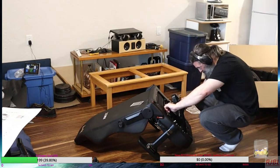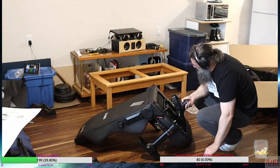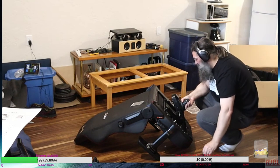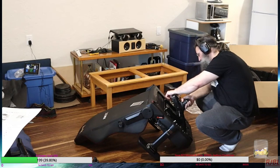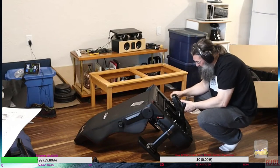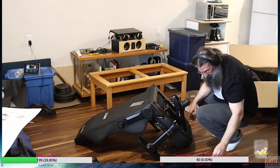Most of the time, if you're tightening down a flange or anything like that, even your water cooler, make sure you cross it from corner to corner. That way you get a proper tightening. If you only do one side at a time, sometimes it makes a bend in it, so one side will be seated tighter than the other. So when you're doing your water cooler, there's four, do crisscross. Don't do one side then the other, if that makes sense. Oh, you can move it side to side too.